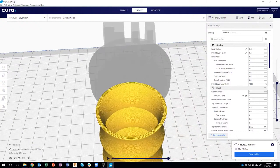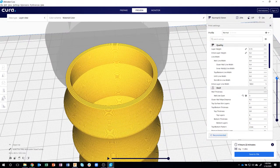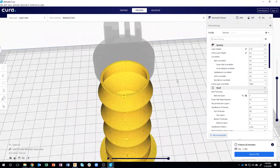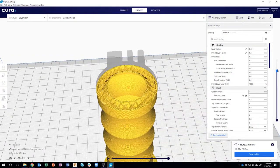And here you can see that we have those solid edges right here. So this is going to print very strong, and water won't seep in, or air won't leak out. That is why I was very specific about my nozzle spacing, x2, x3, x4, etc., so I get a result that looks like this. Again, not necessary, but it's something to think about if you're going to be 3D printing.